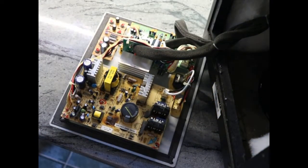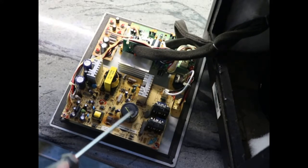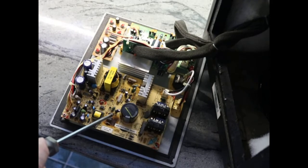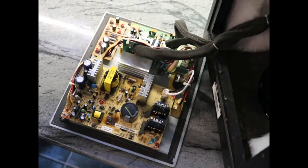What we have here is a switch mode power supply. There's a pulse width modulator chip right here and a transient voltage diode that was here — and this is completely ruined. This typically happens because of too high voltage making it into the circuit, typically as a power surge or transient voltage anomaly, and somehow this circuit absorbs way too much energy when that anomaly happens.